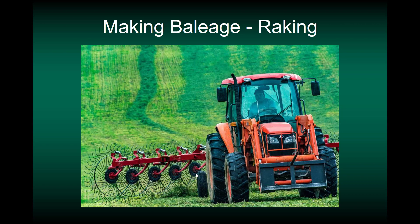Let's talk about raking. Heavier adjustable rakes are good — with a thin crop, being able to move the rake out and cover more forage is an advantage. In Kentucky most rakes are wheel rakes. The tines work at ground level, moving hay or haylage by striking these wheels and moving material back into a windrow. One problem is that if the tines are set aggressively low and scratching the ground, they can move a lot of ash, minerals, or dirt into the hay or haylage, which can lead to problems.